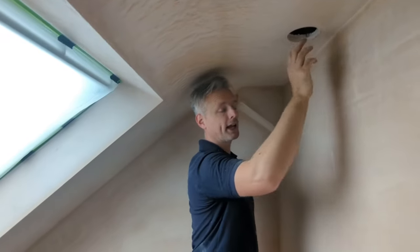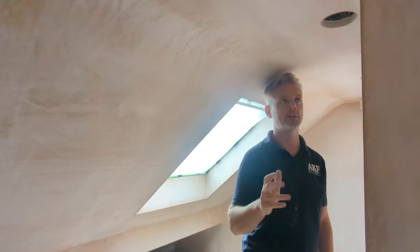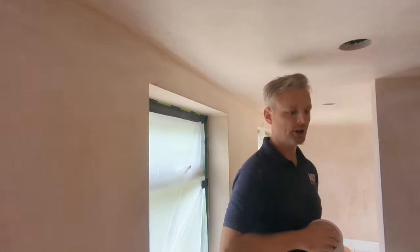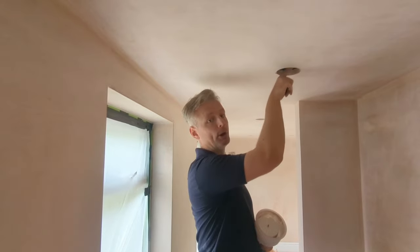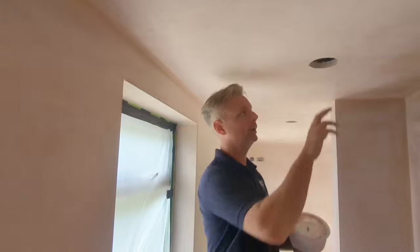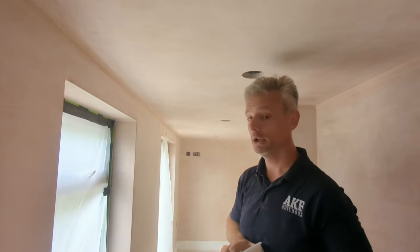That's not an issue — I'm happy with that. It's when you've cut a hole and there's nothing near it at all that you think 'oh God.' Or you've drilled straight onto a joist — that's the real problem. But we're alright. This room is clear and we can paint now. We'll go downstairs and start the others. The bad news is this was always going to be the easy one, because when we insulated and made these pockets, it was always going to be one big 100mm hole finding a big cavity. With the others downstairs, it's a bit more awkward.